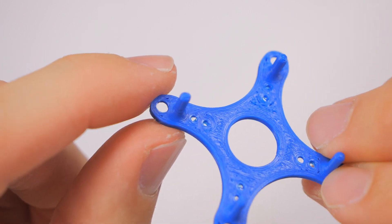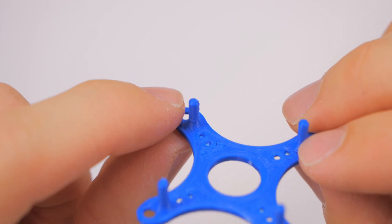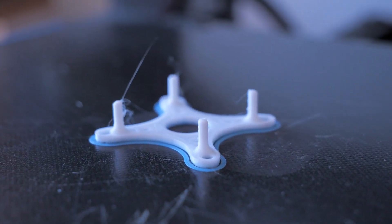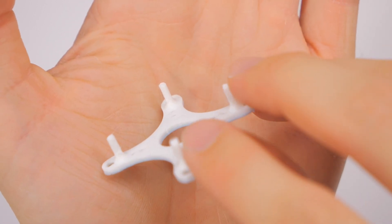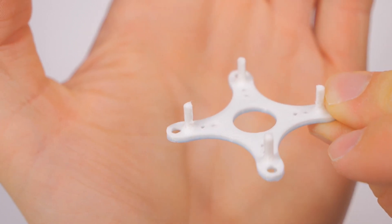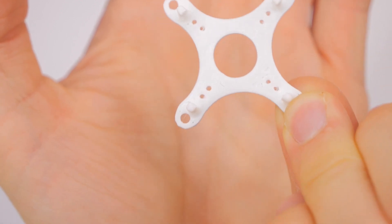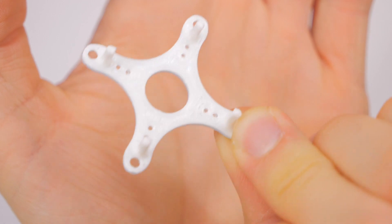Even leaving it out in the rain — conditions I'd think would be done for — the dryer rescued it. Same idea if you get a shipment of filament that wasn't properly sealed and absorbed a bunch of moisture in transit. Those results are pretty concrete. Not an extensive test by any means, but it definitely shows this thing works to dry your filament out and you'll get way better prints with drier filament.